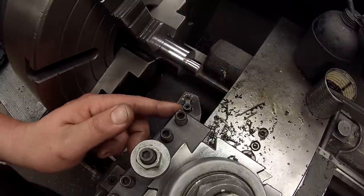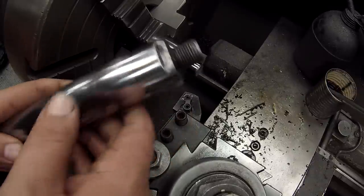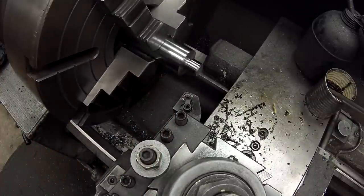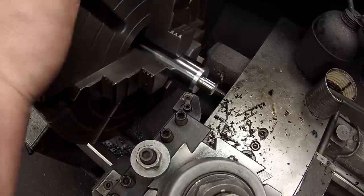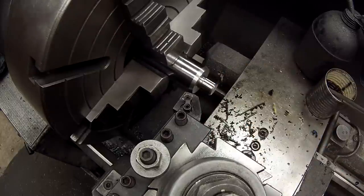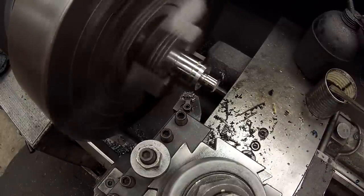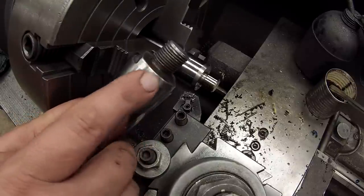I'm going to use my MCKNR tool. We're going to cut this chamfer or lead-in angle there. It's for your seal to come up on. And it'll be 3/16 to 1/4 back. All right. Didn't like me too much there, too fast. It's pretty close. We'll polish this out. Okay, love to do some polishing on that. Get it to look nice and soft like that.